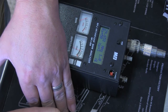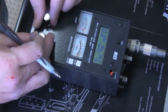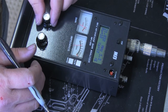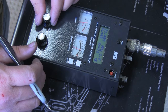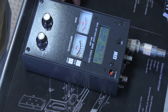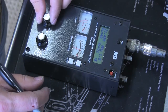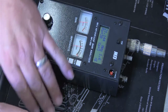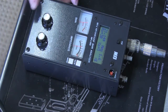We'll go to 15 meters now — that's 21 megahertz. Let's see what we get there. We're going to dial down into 1.6, which is 21.450 at the top of the scale, and 21.480 — pardon me — dip it back to 1.6, that's 21.145. So that's perfect for 15 meters.